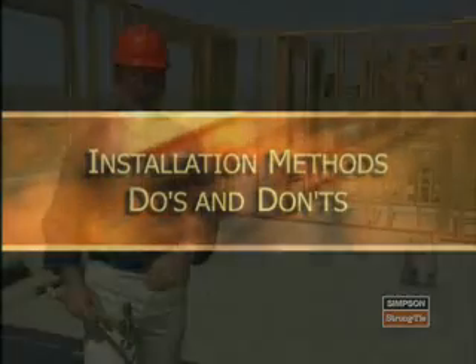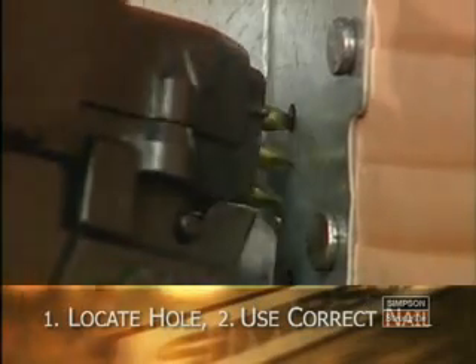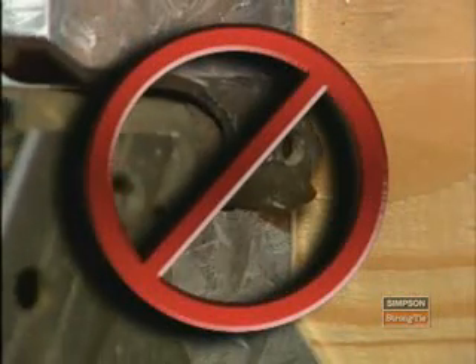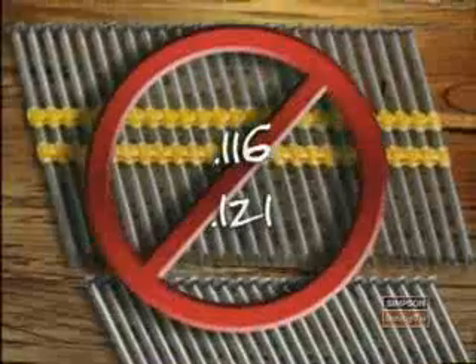Remember, the incorrect use of fasteners is the single most common mistake made during connector installation. Now let's talk about installing those nails. A metal claw hammer is still the tool of choice, but palm nailers can also be used and are a great way of reducing installation time when used with the correct bag nails. Some pneumatic nailers can also be used, provided they have nail hole locating mechanisms and use the correct nail. Do not overdrive the nails — the nail head should be seated flush with the steel. Most standard framing nailers cannot locate holes and therefore should not be used. Furthermore, most collated nails for standard framing nailers are undersized and should not be used to install connectors.